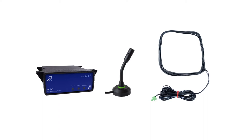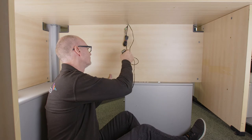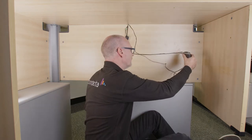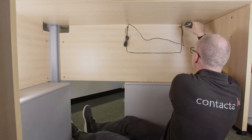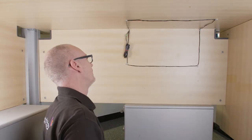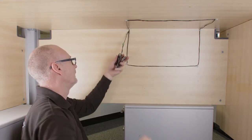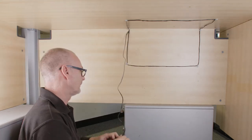Fixings for the hearing loop shape can be pre-drilled. To install the under-the-counter hearing loop, ascertain the intended user's position. Install the hearing loop cable so that the center of the created rectangle shape is positioned towards the intended user's position. Place the aerial in an inverted L shape on the underside of the counter, following the example of the displayed installation.